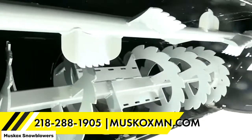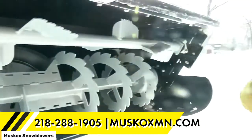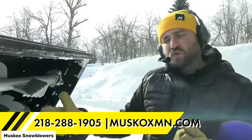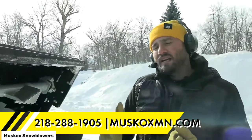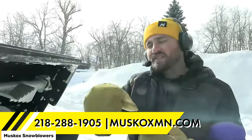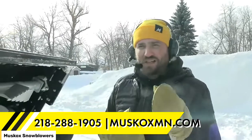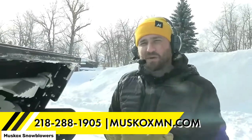So that's why we have two different augers. We find that we are the most efficient by offering both of those features. One for when we're moving forward in hard compacted snow, and then the second for when we're back dragging to really help efficiently blow that snow out of the machine. Fantastic question. And again, Brad, thanks for the question today.